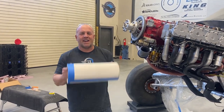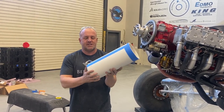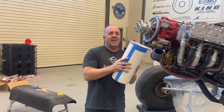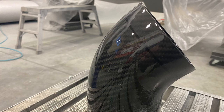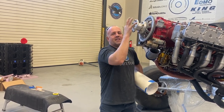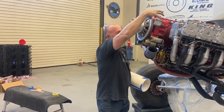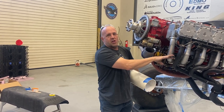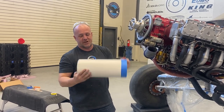All right, guys, I'm gonna quickly make an air box for Scrappy. I'm gonna use a piece of PVC pipe because I just went and found one that was the correct size for a filter. I already made this carbon fiber part. Ta-da! This is to separate the air filter so that the air coming in the high pressure end of the top of the pressure plenum feeds cold air into the intake and into the engine, but has a separation from the hot air on the lower deck, negative pressure. I need positive pressure, cold air intake for Scrappy.